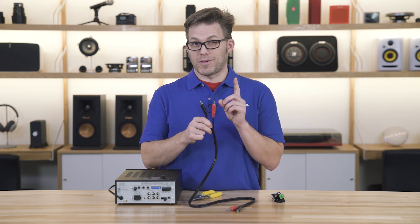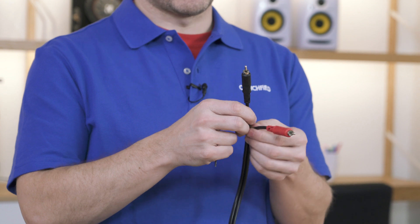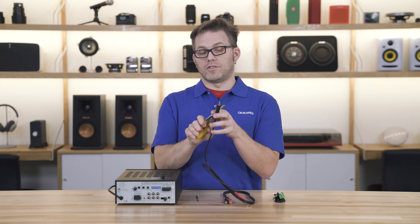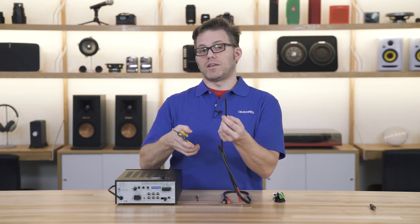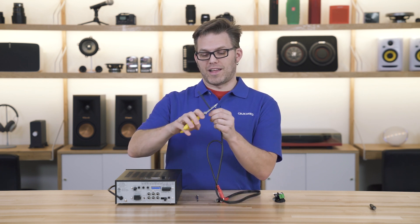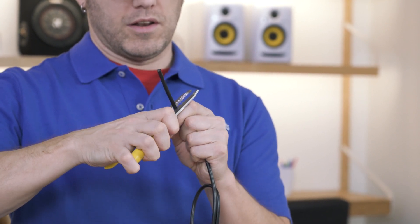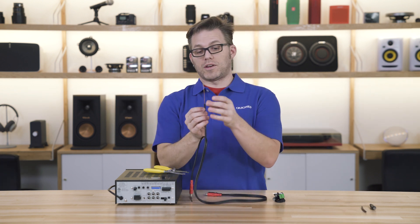On your RCA cables, we're going to start by wiring in a mono — as in one RCA line — into that Phoenix connector first. We're just going to use the one cable. What we need to do is get to the actual bare wire inside, and how we're going to do that is clip the termination right off the end and put that aside. Then, because we're going to end up making a jumper, we need to go back two or three inches to grab the shielding off so that we've got plenty of extra cable to work with.